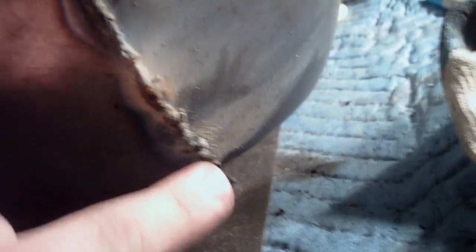So this is what I've done today. I'm showing this full truth in lending - yeah, some of the welds look cold, some of them look hot. I burned through a couple spots, had to readjust, had another pretty bad burn-through over here and another one down here. But this is before they're all cleaned up.